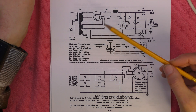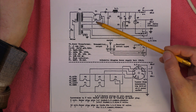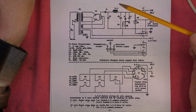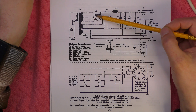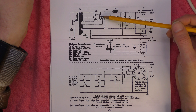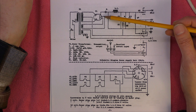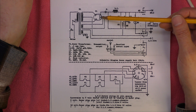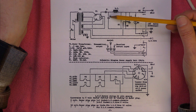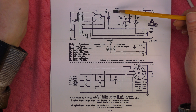Here's the circuit diagram for the power supply section. There's a centre-tap transformer, and each half of the winding is connected to the two anodes of the EZ81. Every time each half goes positive — each half of the mains — it provides a path to the smoothing capacitor. This one has its own transformer secondary for the valve heater, so it puts less stress on it because it's isolated and not down to ground, reducing stress on the insulation. There's a fuse bulb, first smoothing, a nice choke, and then a second capacitor. A choke provides much better smoothing than a resistor, being an inductor.